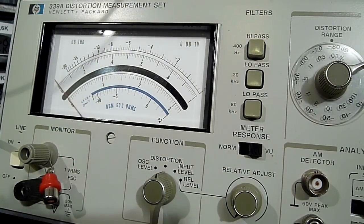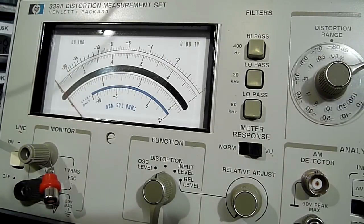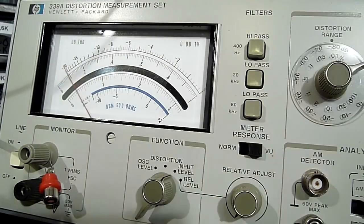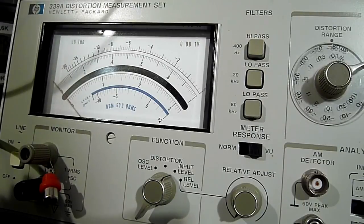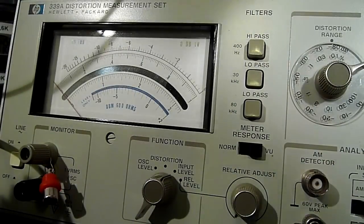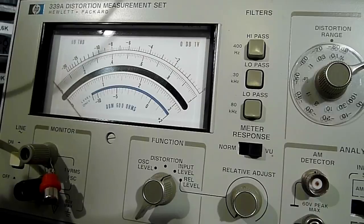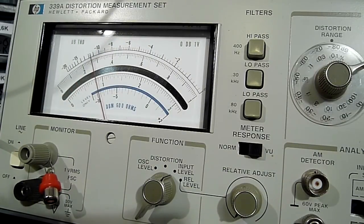Alright, the big moment has arrived. I've hooked it up to my distortion meter and just did a preliminary test, and it looked very promising. So we are set to 1 kHz and let's measure the input voltage. For 200 watts we want about exactly 40 volts. And remember, above 180, before the repairs and the new transistors, it would start distorting quite a lot. So let's go right up to 40 volts. There we are. Exactly at 40,